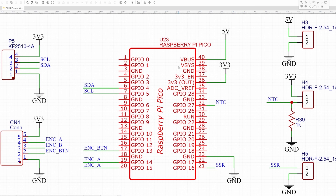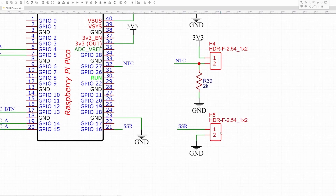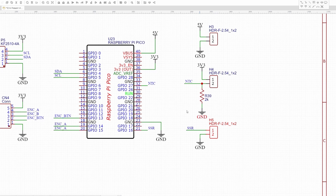This is the final schematic for our hot plate. In the center we have the Raspberry Pico which controls everything. It's a pretty simple schematic since we're just connecting modules. On the left, the LCD uses two lines for I2C communication. The encoder has A and B signals and a button, both powered by 3.3 volts. Up top is the power connector — I'm using a small 5V charger disassembled to step down from 220 volts to 5 volts. The thermistor connects as a voltage divider with a 2k resistor to measure resistance and temperature. The solid state relay has one contact connected to the live wire and the other directly to the hot plate.